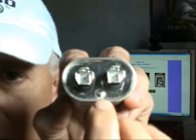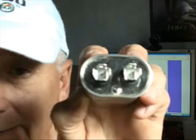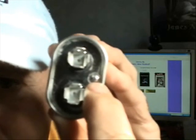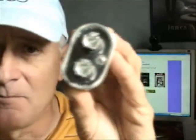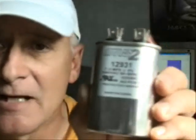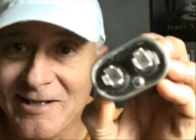One question is in regards to this dot right here, as to what it's for. Well, it's really not for anything in particular. This dot right here is actually where the manufacturer had soldered the hole — where, in the factory, they fill the capacitor with a polyglycol dielectric fluid that's very commonly used nowadays, now that PCBs have been outlawed. To the end user, this spot of solder has no real function. For the most part, you might as well just pretend it doesn't even exist — unless, of course, it starts to leak.